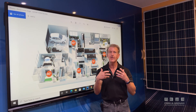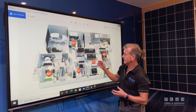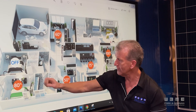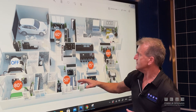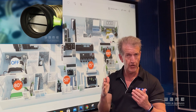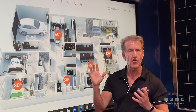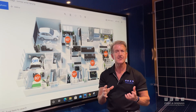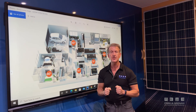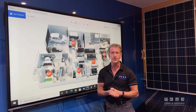Of course, if you're in a room you need it air conditioned, so you turn that zone on. As you can see in this picture, we've got some rooms off, some on, and others at different percentages. If you've got a controller where you can set the percentage open, that gives you another level of control beyond just an on/off zone controller. Regardless, the less zones you have on the better. Turning the whole house on won't harm the air conditioner, but it will certainly make it struggle to reach room temperature.